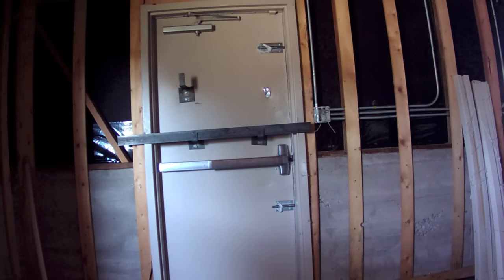We're looking at the inside of the door again, this one with the half-inch steel drop bar. We're starting conventionally, and you can see the adze being set behind the door. If you notice how much flex and give there is in this frame, that's because of the stick frame construction that we're seeing here. You won't see that much flex when you're in brick or concrete type buildings, and you'll actually get more damage transferred into the door.